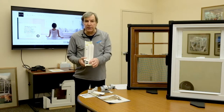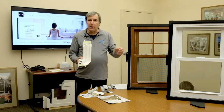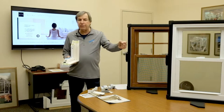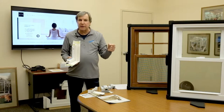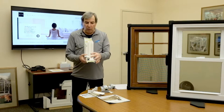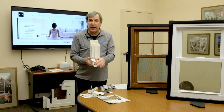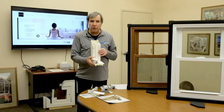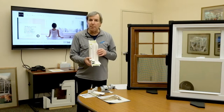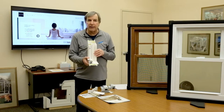In addition, there is a giant bulb seal going around the door. When you open a refrigerator door, you feel a little bit of resistance with that pull because you're breaking the magnetic seal. We do the same thing in the Lotus series. There's a top and bottom magnetic strip, so when you close the window, you've got a nice tight finish. Most of the time you only open and close the bottom sash, that's why we put the magnetic seal in that location.